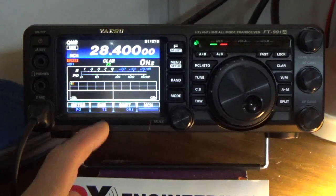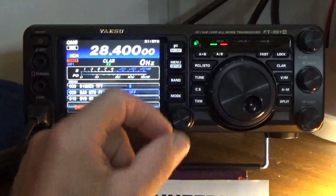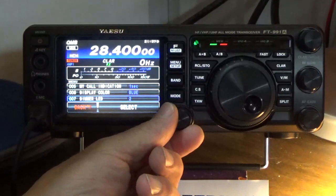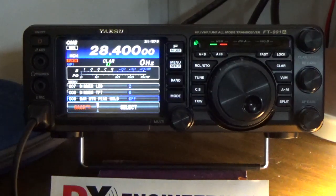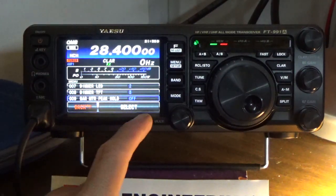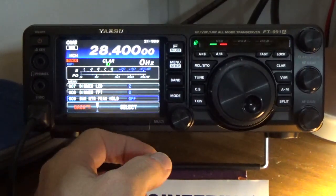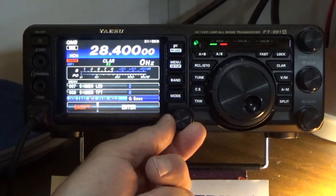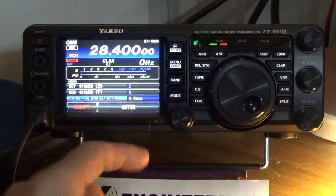Now, this is where the setting is located — it's called Changing Meter Peak Hold Time. We're going to go to the menu and select number 9. It's called bar meter peak hold time. Remember, on these settings, blue is always default. We're going to select it and it's going to become a violet color. When we turn this, it will change color contrast. The options are: half a second, one second, and two seconds. We're going to set this to two seconds.